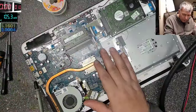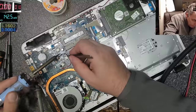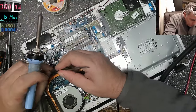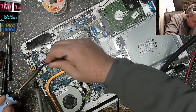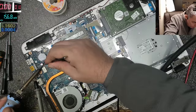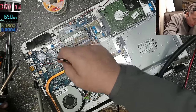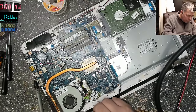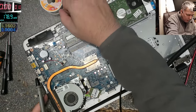Great. Let's unplug the laptop. Let's get this wire from here and move the wire to the 5 volts. Hopefully this switching power supply will work with 5 volts. Let's see now. So now if you are plugging the charger. Yeah, the charger is plugged.